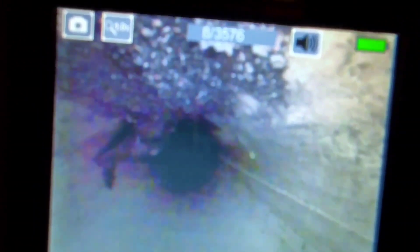Some cracks are big enough that this pipe is starting to fill up with dirt — you can see there's a lot of dirt inside. The camera has spun upside down but we can still see what's going on with the LED light. There's a lot of dirt — no wonder the performance has been compromised. Parallel cracks probably met up and a piece completely came out of place, and then you end up with all this dirt filling the pipe.